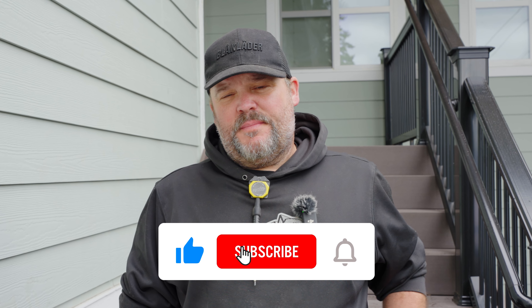If you like this video, don't forget to hit the subscribe button — we really appreciate it. This has to do with international building code, and you'll always want to check your local building codes as well. Where I live, when you build a staircase, you have to have a continuous graspable handrail that's no larger than a two-inch diameter that you can grab continuously all the way up the staircase.